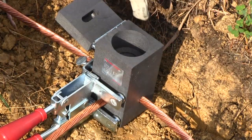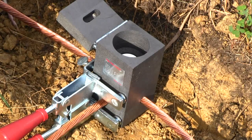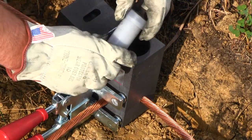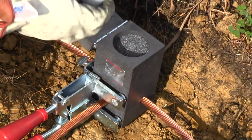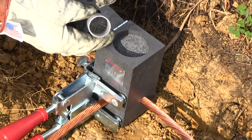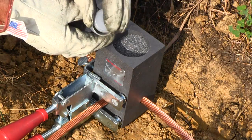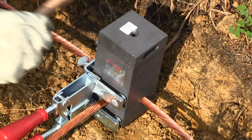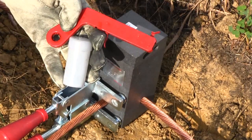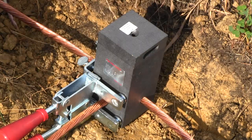Place the steel disc into the mold. The easiest way is to slide the disc down the side of the mold cavity into place. Carefully add the proper weld metal into the mold. This can be sometimes difficult because the container is so full. At the bottom of the weld metal container we pack our starting powder. You don't need starting powder when using the EZ-Lite Remote. We include the starting powder with our EZ-Lite weld metal in case your EZ-Lite Remote batteries are dead or the remote is damaged — you can still use the flint igniter to fire your mold.